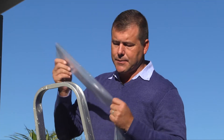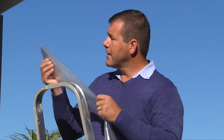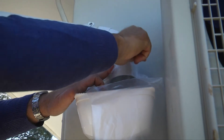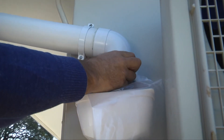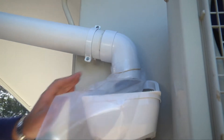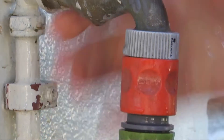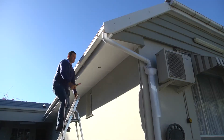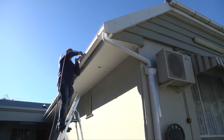As a quick handy tip on how to clean your gutter: take a piece of clear tubing, wrap it around the end of the downpipe with a conventional elastic band, then take a hosepipe and flush the gutter out. We use a clear piece of tubing so we can see all the debris and particles coming through, and we can see when the water runs clear.